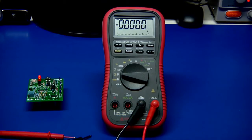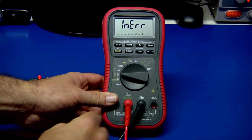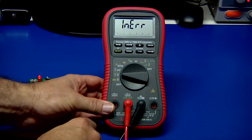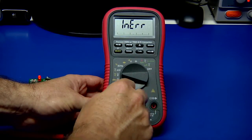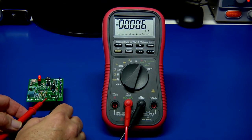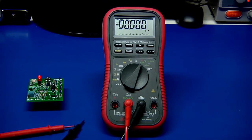We can also measure current. Leaving it on the volts range and moving the probe over shows the error warning — the mode and connections aren't agreeing. Switching to the milliamp range, the calibration source is rated at 0.9999 milliamps. The meter reads 0.999 milliamps — plus or minus one count — rated at 0.15% plus 20 digits. Spot on.